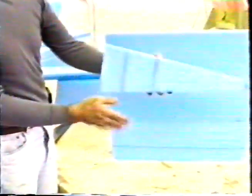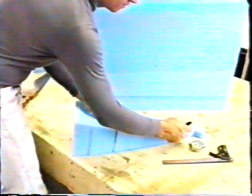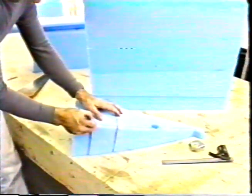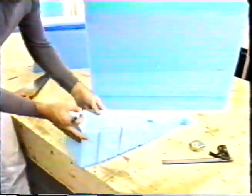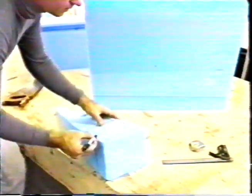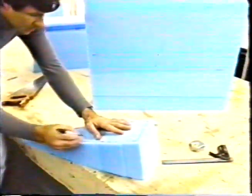This is the surface that was cut earlier, so we're going to put this on a table saw in this position. We're going to approximate 6/10 of an inch and go around the entire perimeter. Now watch what happens here. As I jog down, we'll just average that across that corner, so you're going to be thicker than 6/10 here. We're going to come to here.